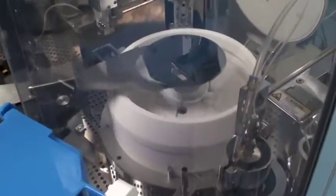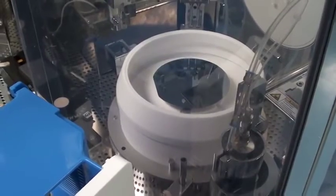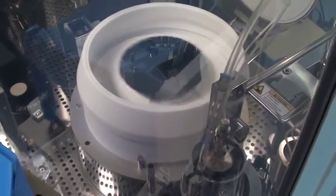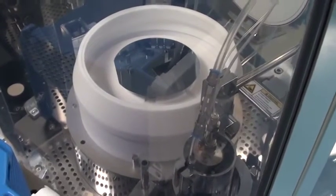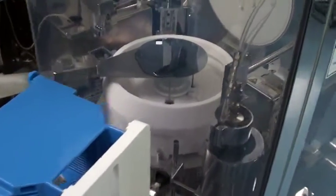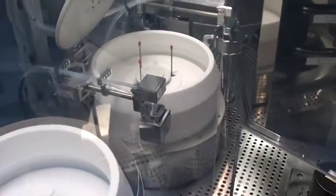As part of our refurbishment process, we have replaced all the resist lines. We have removed the hot plates and re-greased all of the gears on the back of them so that they are completely refurbished and will have a long life. All of the coat stations and developer station over here, you can see, are in absolutely like-new condition.